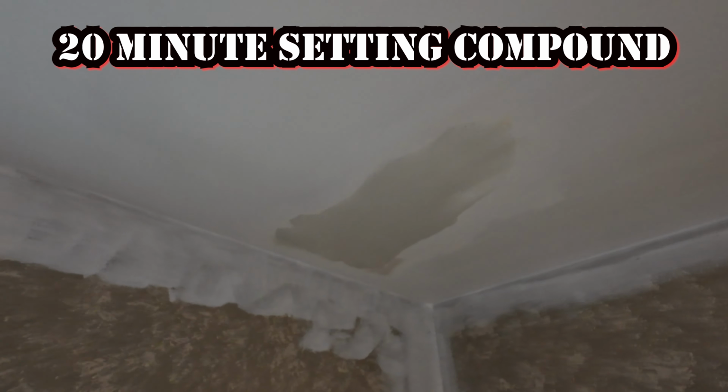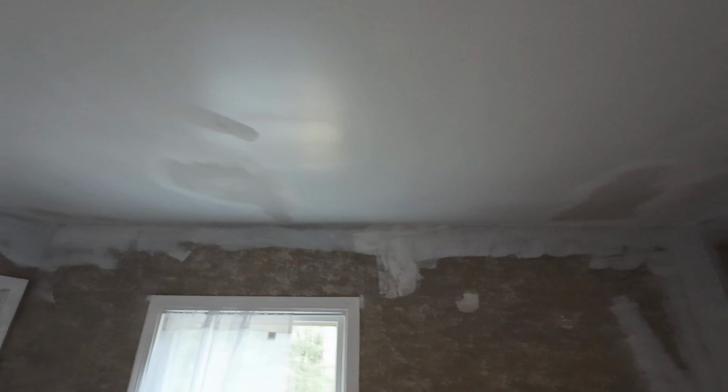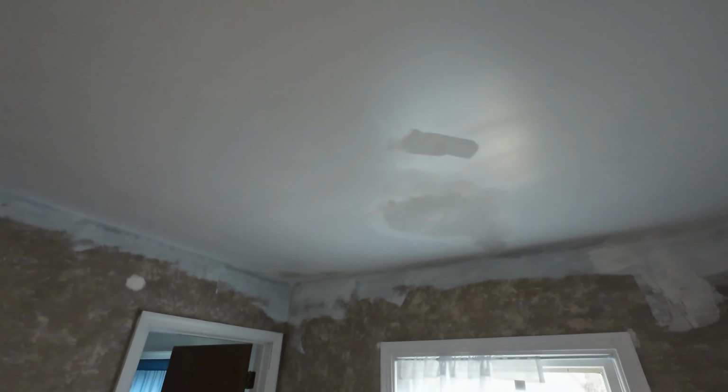By the way, let me cut off to this. Those are those spots in the ceiling upstairs. I don't know if you remember earlier, the mud was taking a long time to dry, and it's hot mud. I had a fan on it and everything, but the house is kind of cold, so I'm just working with it. But to cover up those areas, I primed the ceiling first. Then I put a thin layer of hot mud over that. I think this one ended up being two real thin layers of hot mud. I'm just trying to let it dry, but it'll allow me time to go ahead and prime the walls and get everything else taken care of.